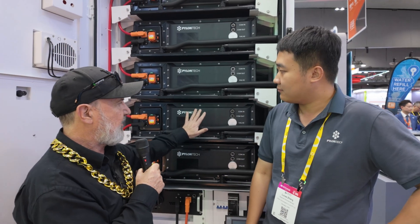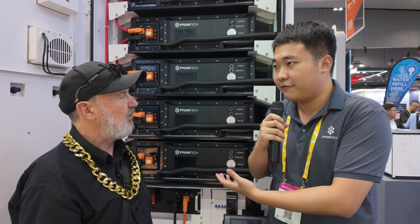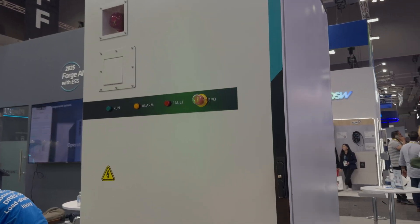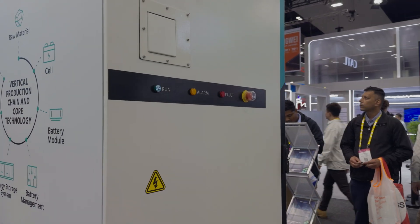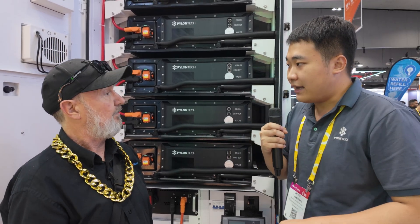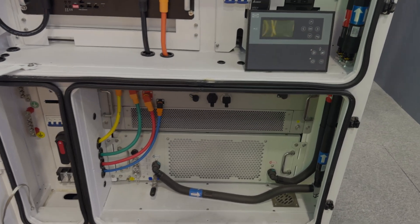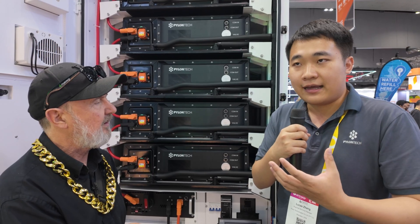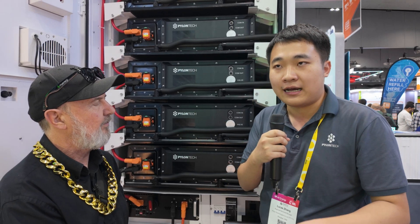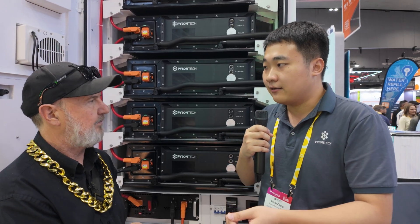So coming back to storage capacity — 260 kilowatt hours — what is the charge rate? The charge rate is 0.5C. The battery module itself is IP67 and the whole cabinet is IP55. There's liquid tubing running around the battery modules with bi-directional valves designed for easy maintenance with no leakage. It's coupled with an AC-coupled PCS module at 125 kilowatt nominal power. We're also developing a next version with a 135 kilowatt PCS module, higher IP rating, and anti-corrosion upgraded to C5M — allowing installation 500 meters from the sea.